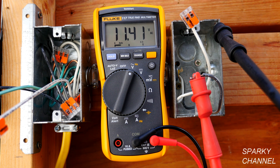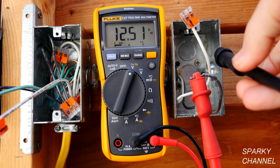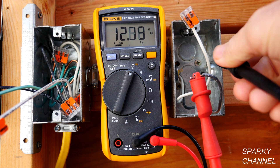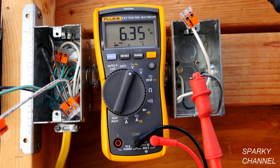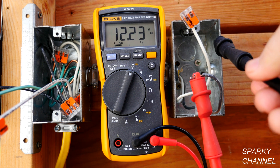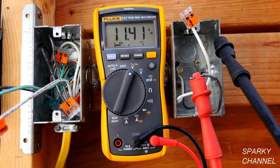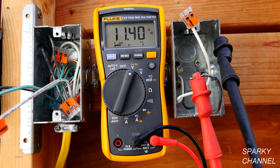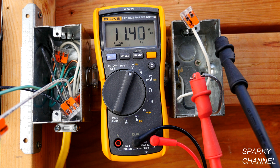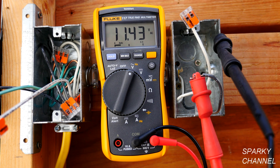This is actual voltage, but commonly we call this a ghost voltage. You take it off and you get a ghost voltage of 5.9 volts. You put it back on and you get 12.4 volts. So what happened there? The metal box is providing a tiny bit of ground. That was the point I was making in the previous video — a regular metal box that isn't bonded to the grounding system of the house doesn't provide a ground for your electrical wiring, but it actually does provide just a tiny bit.